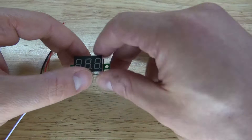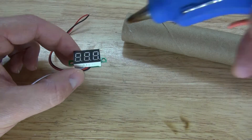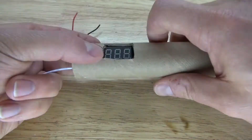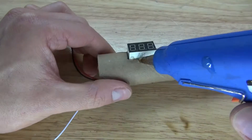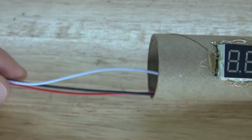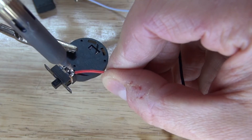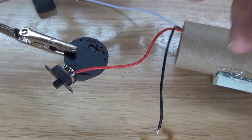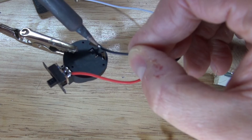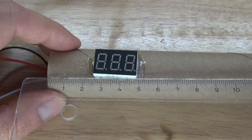Next I'm going to take my volt meter, place some hot glue on both ends, and push it in. Then add more hot glue around the volt meter to hold it in place better, leaving the wire sticking out. Take the positive wire and solder it to the switch — it should look just like that. Next, take the negative wire and solder it to the negative terminal of the button cell battery holder.